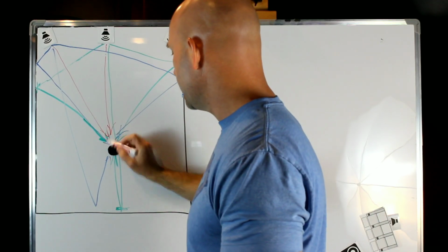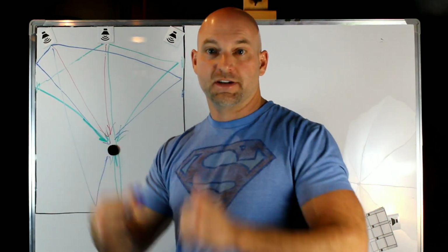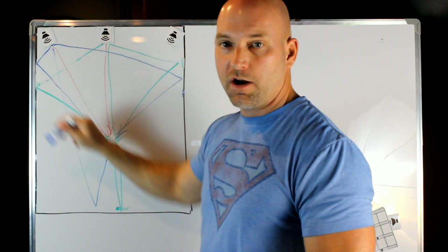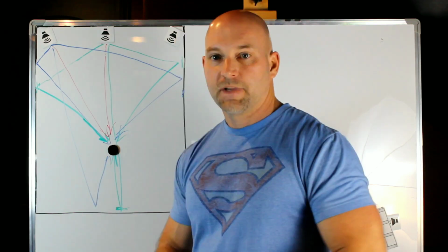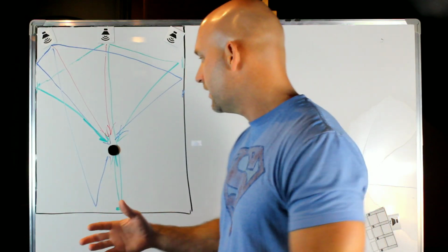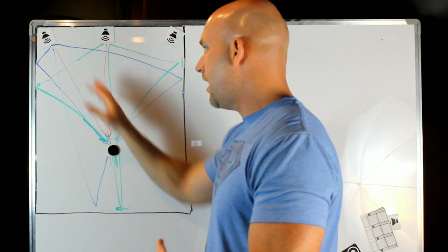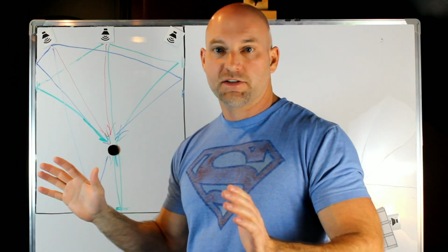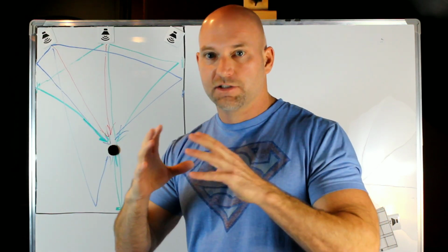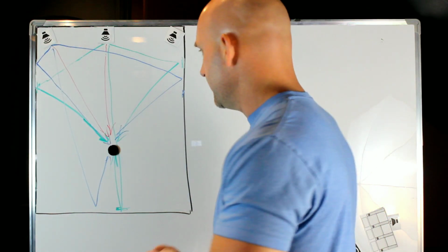So, just out of these 2 speakers, we've got 2 direct sources of sound. And if we were out in the field, that's what we use to determine our 6 dB per doubling of distance. But there's all this other stuff going on in the room. That's extra output. Now, when you run auto setup, or you take a measurement of one of your main speakers, or your center, or any speaker in the room, you're not measuring this direct sound by itself. You're measuring the combination of the direct sound with all the reflections, and it makes what's called the sound power, which is basically the accumulation of all of the sound from this speaker in the room. It's the room and the speaker combined.